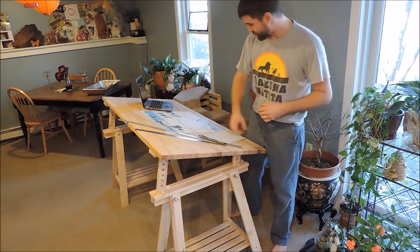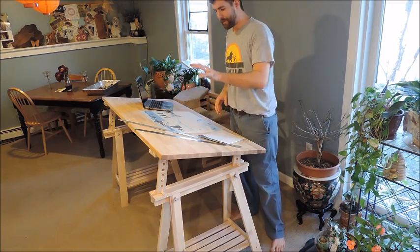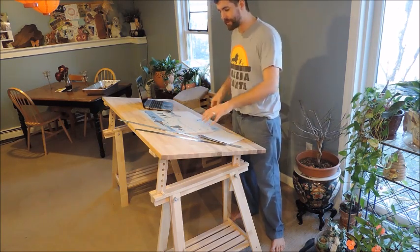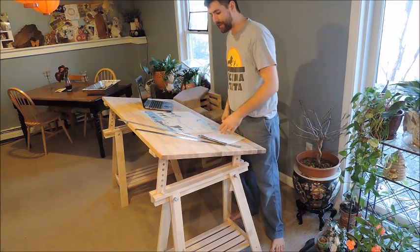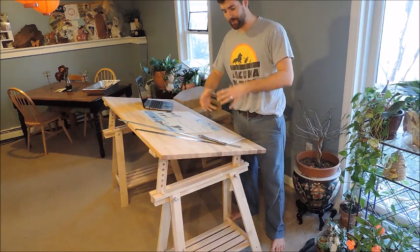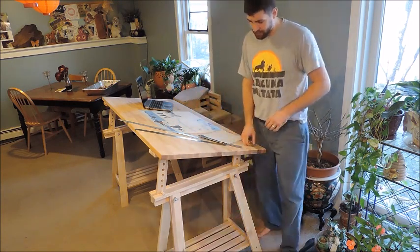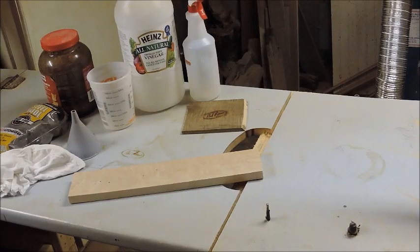And for the tabletop, I'd like to hit that with a blowtorch. Maple, beech, birch, those are trees that have a lot of sugar, obviously maple syrup, right? So they have a lot of sugar in the wood, and when you hit it with a blowtorch, it actually caramelizes and sort of burns and creates these golden colors out of that sugar inside the wood. So we have these very plain colors, and without any further ado, let's get into it.